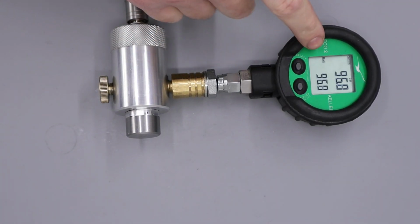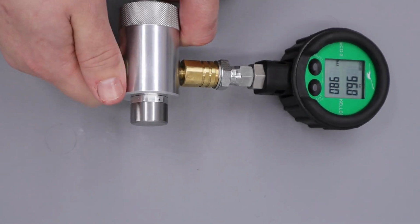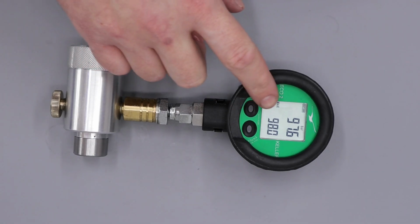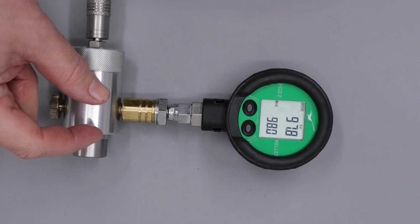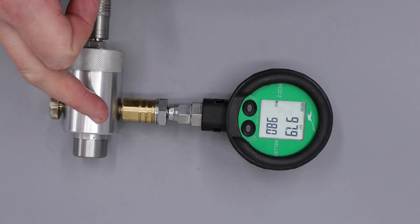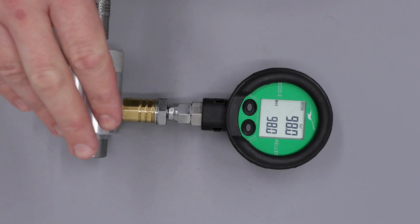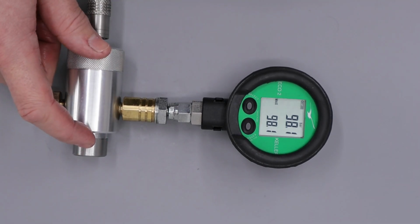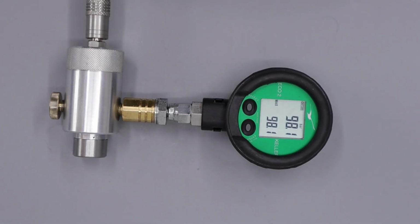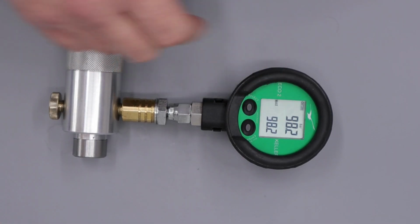It will take a little bit of time for the gauge to settle, and the regulator itself will need a few dry fires to cycle properly. So there we have it, the regulator is settling around the 98 bar mark. I will say that this setup is particularly bad for regulator creep. What we have here is an absolutely microscopic plenum, and any small change in air temperature will show up on the gauge. Normally what happens with these testers is you mess around for a little bit, the air temperature stabilizes in the unit, and then everything slows down on the gauge. Obviously as well, this is a brand new regulator with all new O-rings, so it will take some bedding in. Generally speaking, as long as the regulator is working as it should at this stage, I normally give them between 200-250 pellets just to bed them in. So a little bit of creep isn't worrying me at the minute.